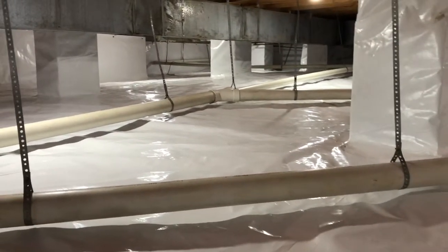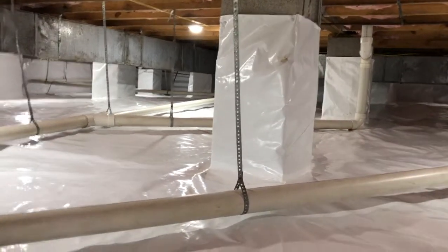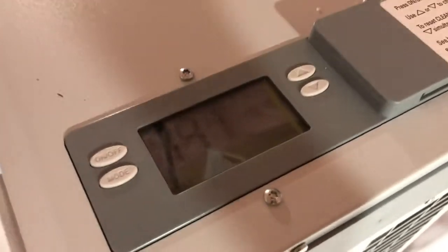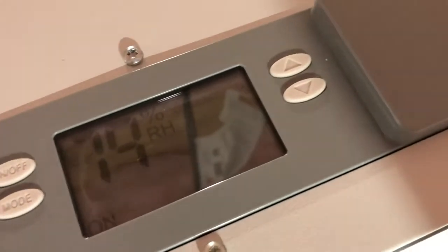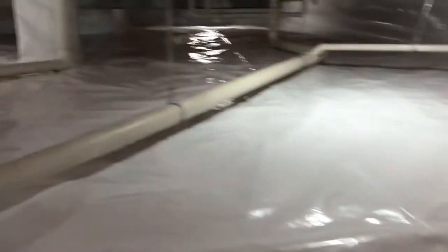I mean, we already gotten the dew point down enough to where the ductwork isn't condensating like you saw on the before. It's nice and dry now. But when we plugged this thing in, it was at 89% humidity. Where are we at right now? 2 hours later, we're down to 79. Still very high, but it'll take some time to bring it down.